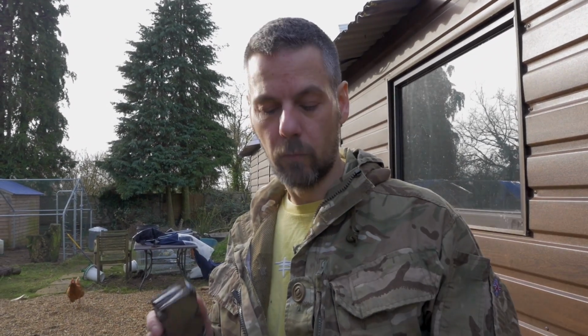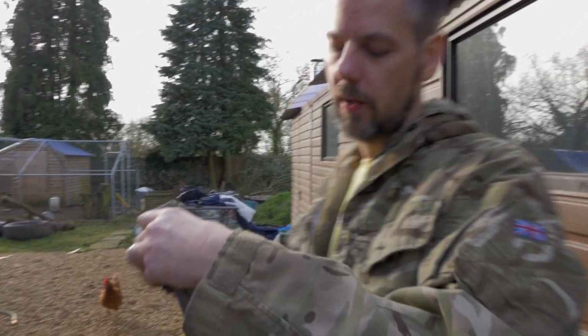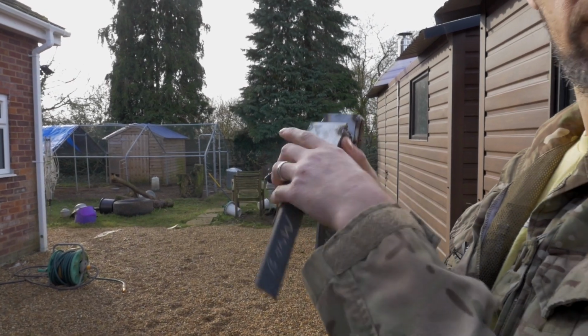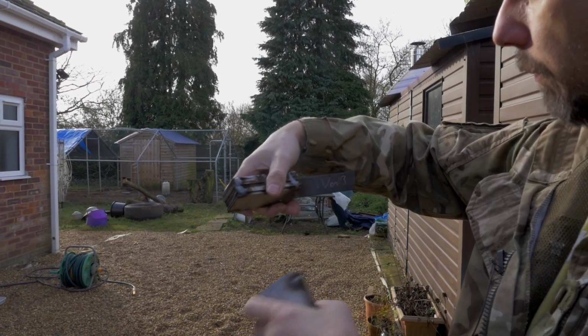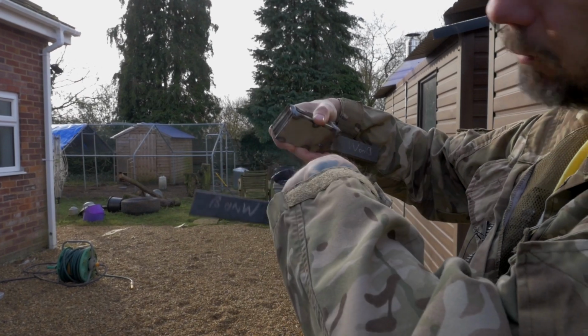Okay, I just stepped outside of the forge for the moment because it's very noisy with the forge being on. Just want to show you our two stacks that we've created. What I've got here, I've got black on white, so I know that this has got a majority of black and white at the bottom. And then white on black, so there's a load of white, so that's the 15N20 and 42 at the bottom. So we've got two different stacks. I'm going to do the white on black, Mini Doobs is going to do the black on white.